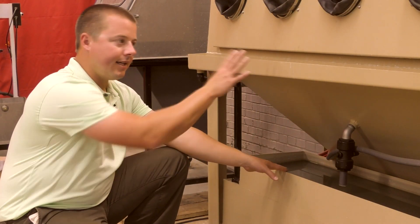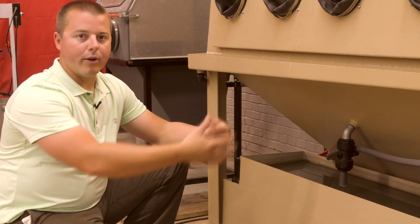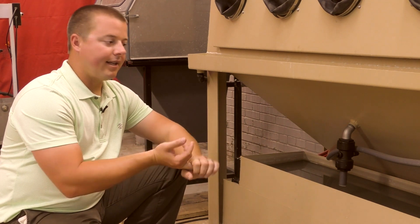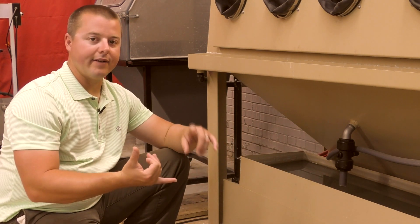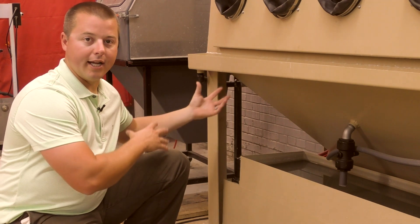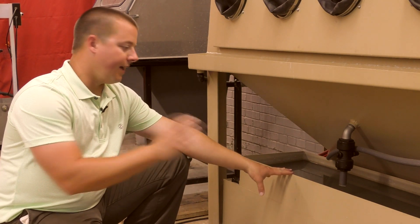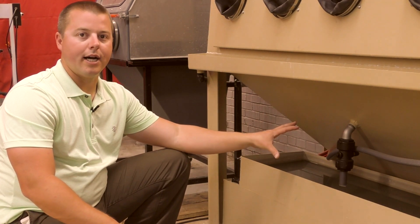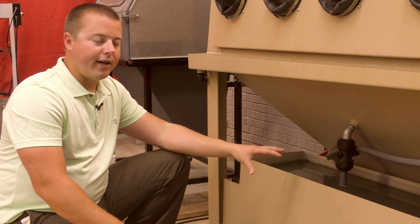So when we're adding water from the basins into the machine, the machine is going to expel the excess water needed to keep operating efficiently. This has many advantages — obviously it offers filtration for solid sediments, any types of oils and contaminants that come out of the machine. It also gives you the convenience of not having to have a drain close by and not having to add a water connection from your plant or building. This is your water supply to rinse parts and rinse the window — that's all this is for, plus filtration. It is not to operate the machine. The machine has its own water supply, and it regulates and equalizes between the cabinet and the basins.